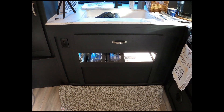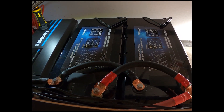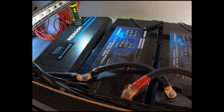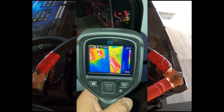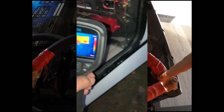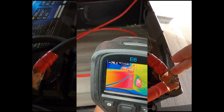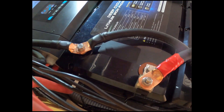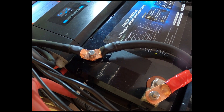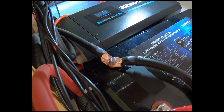I have these batteries installed in the front storage bay. Given the size of these, you can see they're quite small for the power they have. You're going to want them all tied down. I also have some thermal imaging pictures showing the cleanliness of the terminals — flat, clean connections. I have fuses installed under each positive terminal. If you don't know anything about rating fuses, I'd strongly recommend looking up the NEC ampacity — there's good literature out there for systems like this.